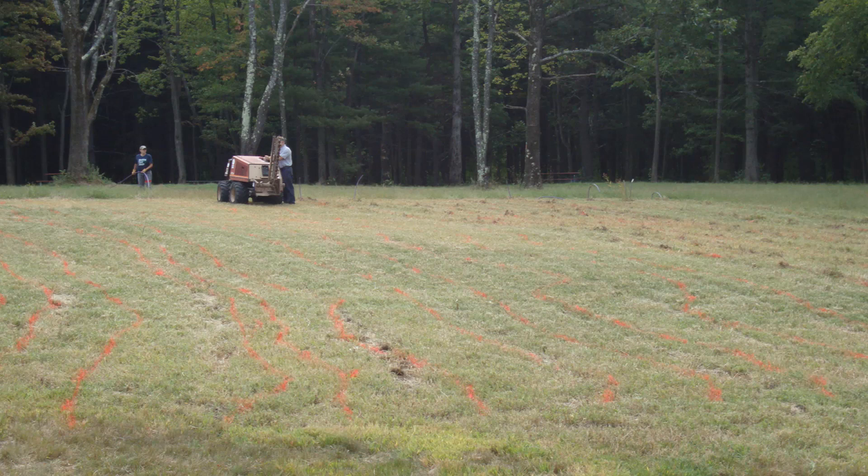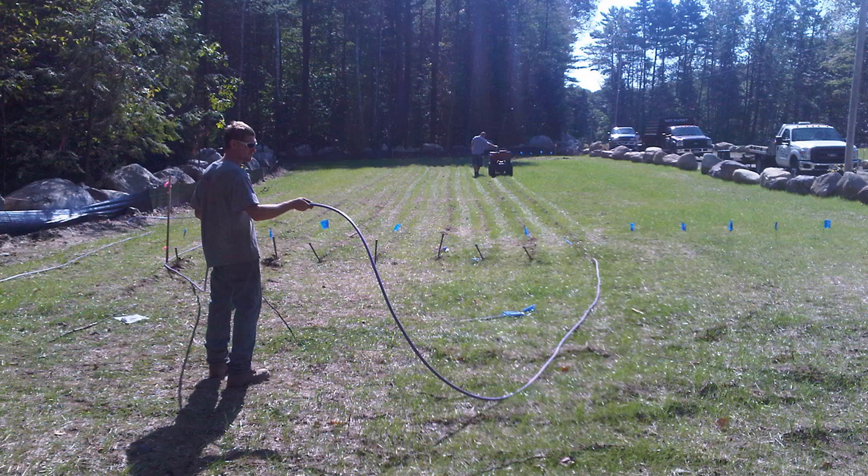If you're not installing on a sand bed and it's going to be plowed into existing grade, you want to make sure you have the equipment ready. Here is a vibratory plow with a trenching attachment on the front. Most importantly, notice all of the paint marks — the site contractor went and established what the contours were on the lawn and did paint lines. This makes it a lot easier to trench the tubing in because you know exactly where it needs to go. Off to the right of the picture you can notice that already several lines have been pulled in. On the left side of the picture, there are more lines for future runs to be trenched in. For a more flat, rectangular site, another way to prepare your lines would be to use flags — a flag at one side of the field and a flag at the other side, and you're just going to pull straight along that path.